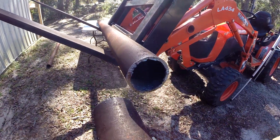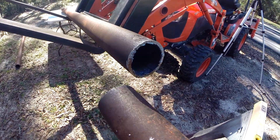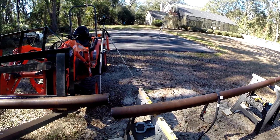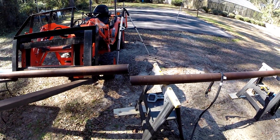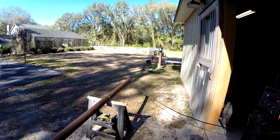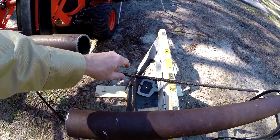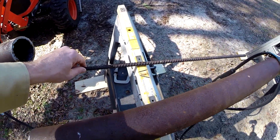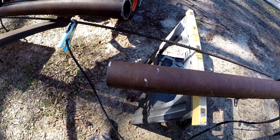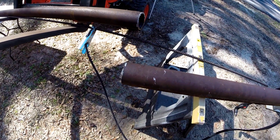There you have it — she's hot, looks pretty good, not bad. Went right through it and now we got our two pieces. These are the back side of it, ten-and-a-half footers. I'm going to try one more thing before we put these in — I'm going to cut a couple of pieces of rebar, cut some holes down here, and stick the rebar right through there. That should help hold the steel pole into the concrete tighter.